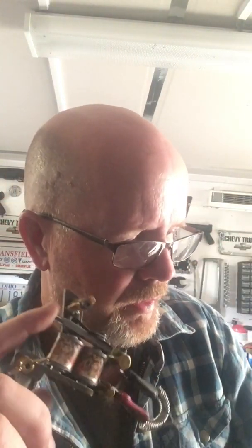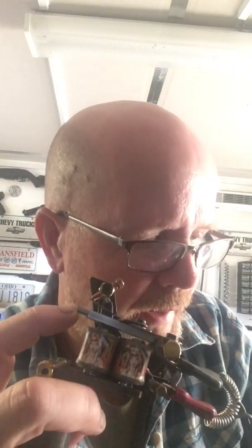So, what we need to get used to is adjusting that front screw, the contact screw, along with your voltage for optimum settings, for the power you need, for the amount of needles you're driving. You don't want to overload on the power if you're running 3 or 5 needles for lining, because you don't want a massive amount of power. You don't want to blow your lines.